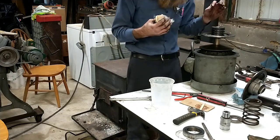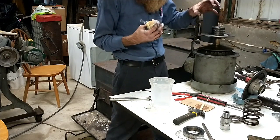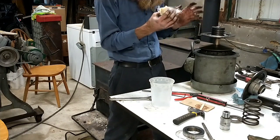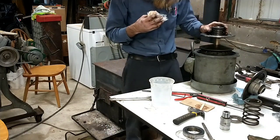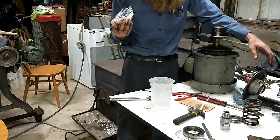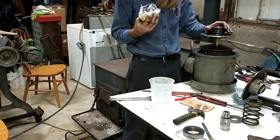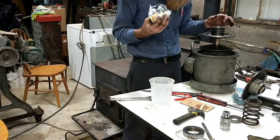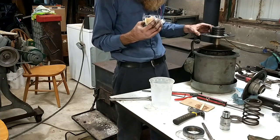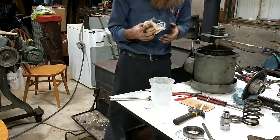Matter of fact, I don't just Loctite up the screw. I put a bunch of Loctite in around the key when I put it in. Like, fill in the gaps, give that thing as much support as you possibly can. I don't worry about the front ones. Those ones, frankly, I don't ever see give trouble, and they're an all plastic key. But this one, where it's plastic wrapped around a steel core, bad stuff happens if that thing comes loose. So Loctite her up, red Loctite, and you'll be good to go.